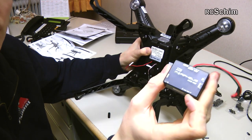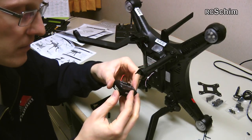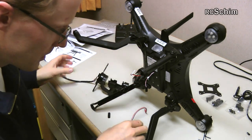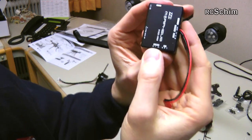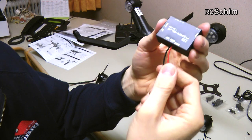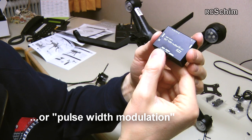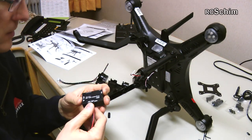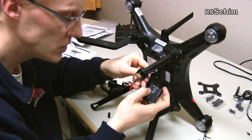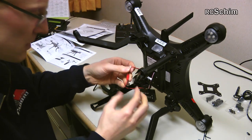It's important to have this side facing up when gluing it to the copter. There are lots of connection ports that all connect to the gimbal cable in three different sizes — you can connect them wrong, so be careful. There's also an SBUS connector and a PC port for USB firmware updates. Here's the power cable. The communication standard used is PWM. Over one servo cable the gimbal is connected. G stands for ground — ground is black, so polarity must be correct. You can shrink-wrap the connections.